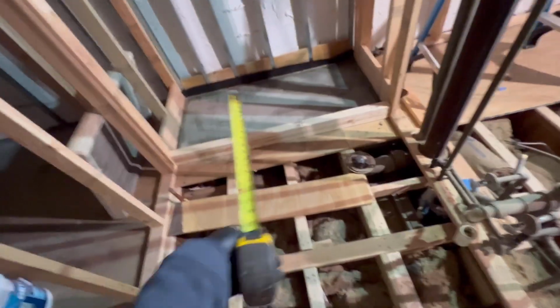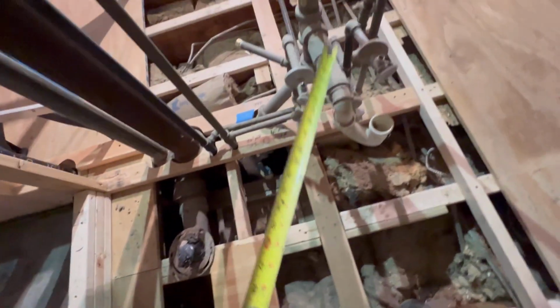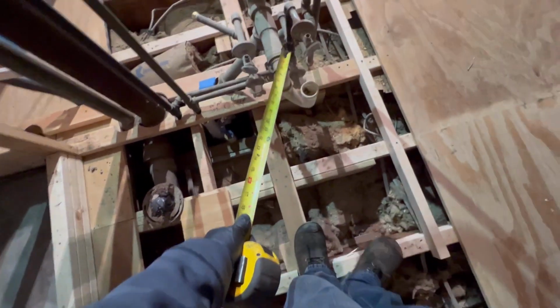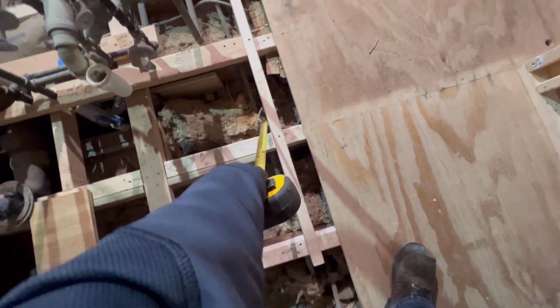Here's this 5x7 standard bathroom that we're roughing in. He's got the shower pan right here that he converted. It was originally a tub. He's got the 4-inch water closet here. We are going to turn this into 3-inch. We're going to cut this ferrule right here and move this toilet over about 4 inches. He's got an 18-inch floating vanity going right here with one pull-out drawer. This is the end of our bathroom right here.